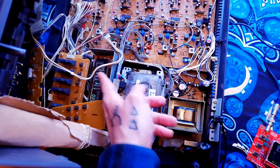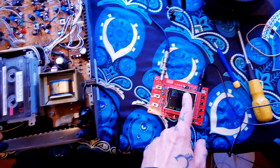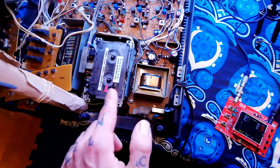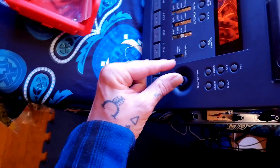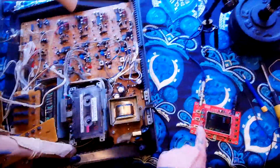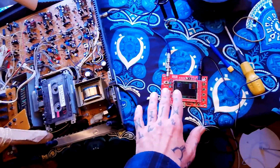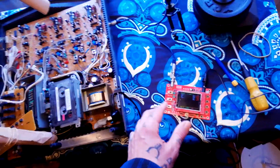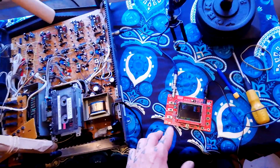This is also functioning as a frequency counter so I can adjust the playback pitch to get exactly the right frequency, so that with the pitch control at 12 o'clock it should be in high speed mode at exactly three and three-quarters inches per second. In other videos I demonstrated using a Chinese DIY frequency counter, but I began to find problems with that — I tried to make some reference tapes and things went badly wrong. I'm pretty sure it was the meter throwing me off, so I stuck that in the bin.